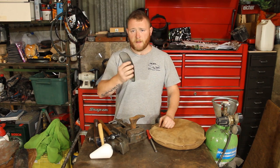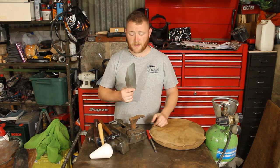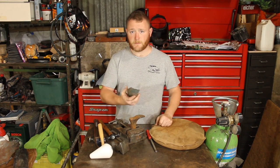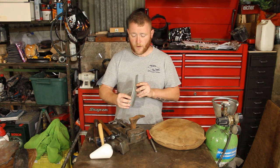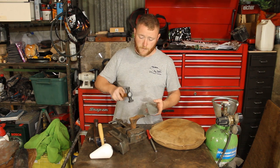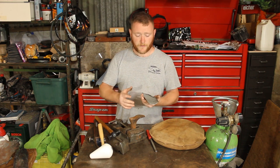The more time you take on it, the better it'll be. It's not a complicated thing - there are no specialist tools involved, no specialist techniques. It's just one of them that just takes time. Keep having plenty of breaks because otherwise your hands get fatigued. I just did that quickly and roughly and it took me probably about an hour and a half. If I'd spent probably two or three hours doing it a bit slower I'd have had a neater finish. Obviously I haven't finished the edge off, but to get that nice crisp edge just keep going around. When you're finishing - same as any panel work - make sure your hammer's flat. You don't want to be digging the edges in. Just take it easy so it stretches incrementally rather than ending up with tucks and rolls.